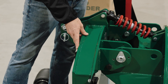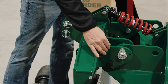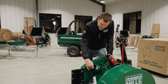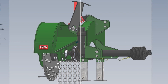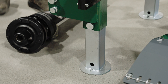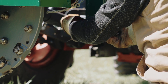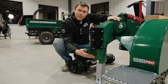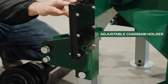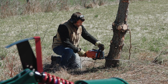For the back frame, because of the horsepower range and the size of tractors we're going to be working with, we've gone with 3/8-inch thick plate both front and back, and then a half-inch thick plate which comes forward to carry the pivot of the flywheel housing. This half-inch plate then passes through this face all the way to the rear face where it's internally welded to give us a box beam structure and the rigidity we need when grinding those large stumps. At the bottom of the back frame, you'll see our leg supports. These have both a storage position as well as an in-use position, which is going to let you get the legs up out of the way and grind those stumps to 8 inches below grade without sweeping the bottom of the stump grinder. The chainsaw holder gets bolted to the side — it's adjustable for different bar sizes to keep your chainsaw with you when you're heading out in the field and forest.